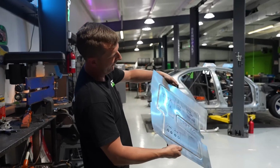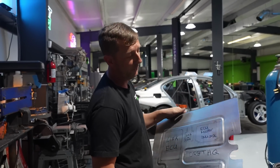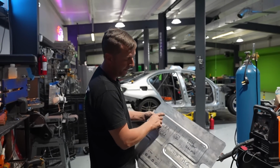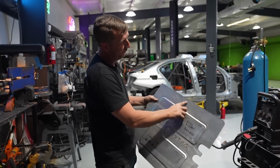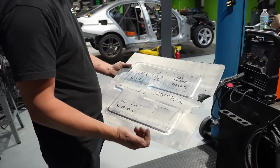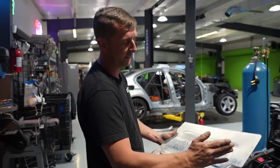So as you can tell, this has a little bit of warpy warp to it. So the trick to getting rid of that is give yourself a little bit extra meat on the bone. And if you do that, you can take and break it here and then break it here, and it'll actually even it back out. So you add a little bit of flex to it and it'll straighten it out.